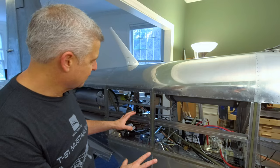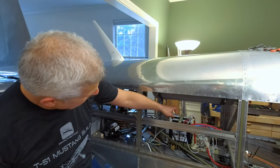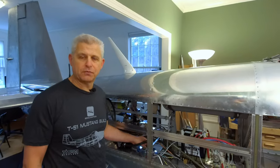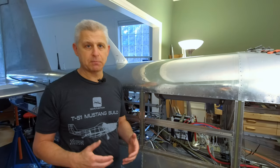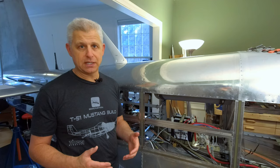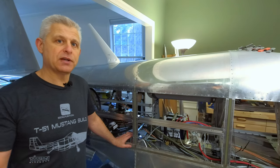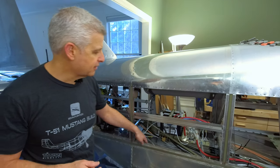This cool section has our push-pull tubes — everything's in here. Next in this section is our reserve tank, our reserve fuel tank, and the line that comes down from it. We have this all electrically controlled — both a solenoid-controlled valve and our fuel pump, to ensure that we move fuel out of this as quickly as possible. It would go through gravity feed down to our main tanks when it's time to transfer reserve fuel, but the solenoid valve and pump will work a lot better against the head pressure. All of this comes out and moves forward.